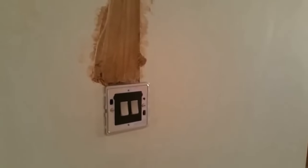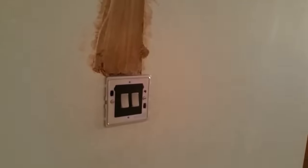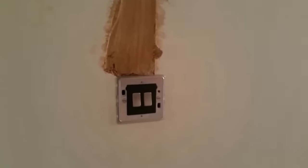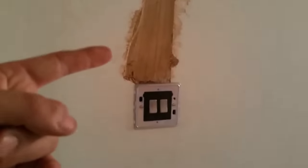Pendants in a few rooms — pendant there. The customer, as you can see, gave us some fixtures to stick up as we went. Again, kitchen — bonding in the walls. We do this purely because we don't want our conduit and cables exposed. In the past I did a project and I didn't bond it, and I went on the impression that in a week to two weeks a plasterer would be in and the house would be looking back to normal again. I turned up at that property a year later to do another little job and the cables were still there. So everything gets bonded now.